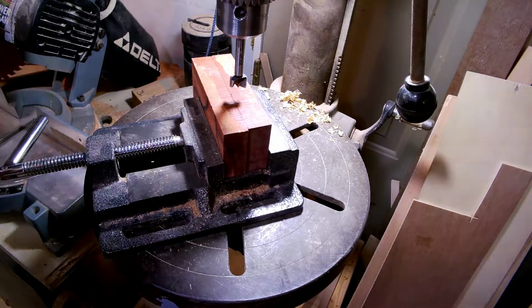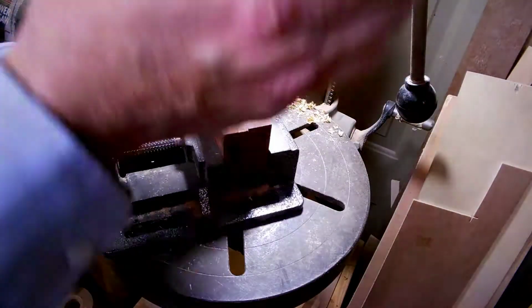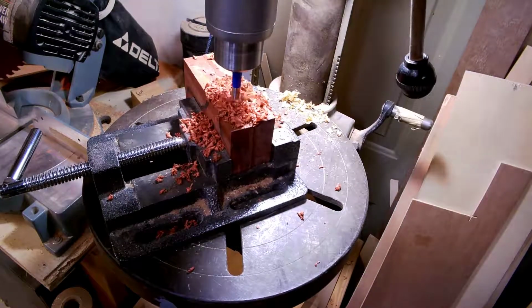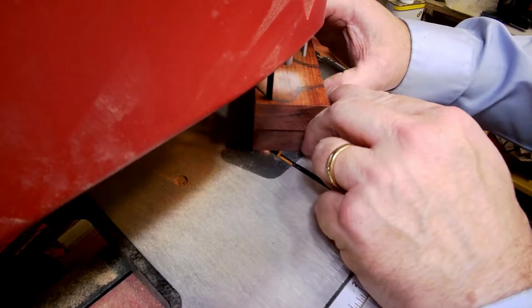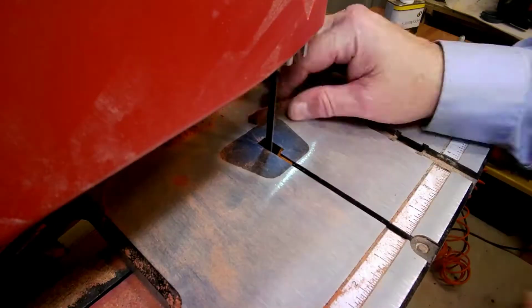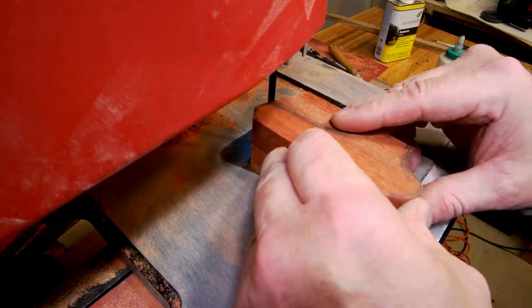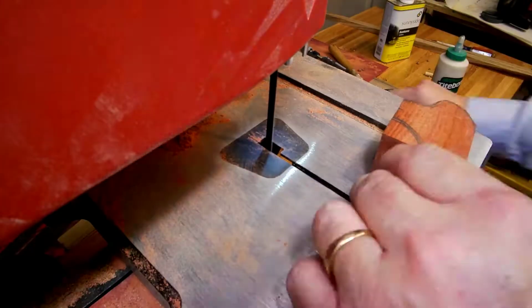So in order to attach the two pieces, I'm not actually going to take the shaft and drive it into the handle. I wanted the width of my handle to match the width of the shaft, which means I'm going to have to come up with a fastener between the two pieces. I happen to have in stock 5/8 of an inch thick dowel rods in hickory. So I drilled a hole in the handle that was 5/8 of an inch thick to take that dowel. Hickory is pretty tough stuff too. It's a good, strong hardwood, and that would make a great dowel rod. I didn't want to use a thin one, so that 5/8 inch hickory dowel is going to take up a lot of space inside the handle and also in the shaft.